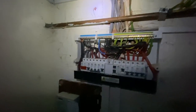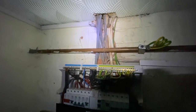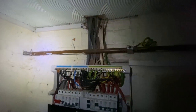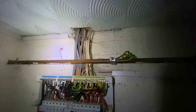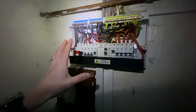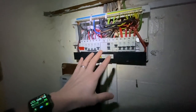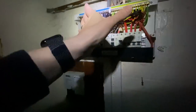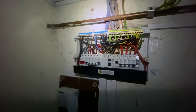There's a bit of a funny trunking setup here — I'm going to pull that off. It's a bit of a bodge, so I need to figure out what to do to make it neat. I don't like the cables going behind that gas pipe but I don't see much of a way around it. Let me know in the comments what you would do. I'm going to start taking the old board down, labeling everything as I go so I know what cables do what circuit, then tidy the cables and mount the new board.